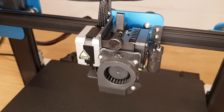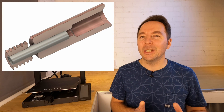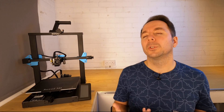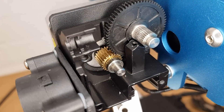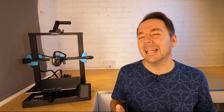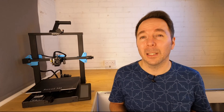Another potential area for improvement is the hot end. Sovol have used their own design of heatbreak, which means that upgrading to something like a bi-metal one is not an option with off-the-shelf parts. If the SV did ship with this slightly more expensive heatbreak it could genuinely compete with models like the Ender 3 S1 Pro which is able to print at higher temperatures. The only thing really stopping that at the moment is the PTFE liner in the hot end that can't go over 260 degrees. Also, even though there is a section of PTFE tubing through the hot end, it doesn't extend all the way up to the extruder — instead there's a drilled metal section. I don't really fancy cleaning out a clog if it were to happen in that metal section, and considering all it could take is a slow retraction of filament through this area, I could see it happening to some people. The SV01 Pro also only has a single extruder gear, which could cause a lack of traction on filament during some prints.